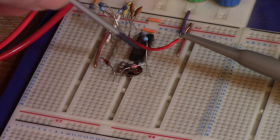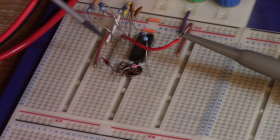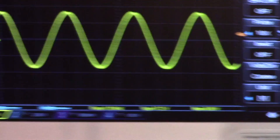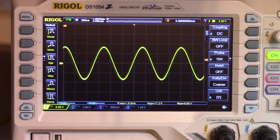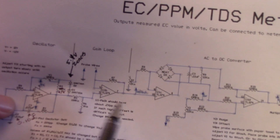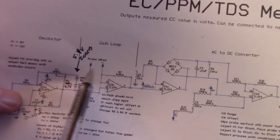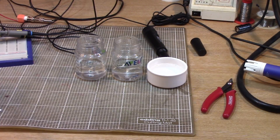I'll just give you a quick look at what I've built so far. This is the TL074 quad op-amp chip, and everything else is just little resistors and capacitors. I had to tweak a few component values because I didn't have exactly the ones listed on the schematic. However, I do have a beautiful 1.5 kilohertz sine wave — very stable, not affected by voltage changes in the power supply. I've now got more of the circuit built with the gain loop section, and the EC probe is connected into the circuit as well.